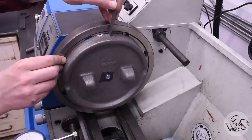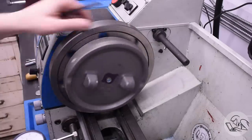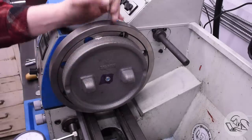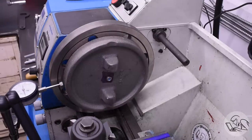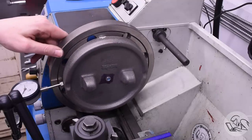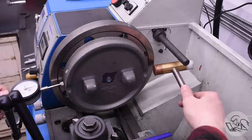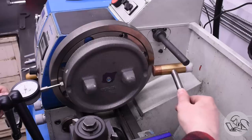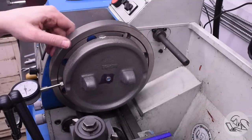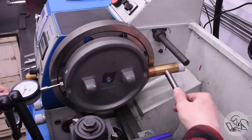To get this thing dialed in it's going to be tappy-tap-tapping time. I start with a scale to get it in the ballpark — that'll save a lot of time with the dial indicator. Once it looks good with the scale, I bring in the indicator. Again this thing is not round and it's a rough casting, so dialing it in is a bit of a fool's errand, but we do the best we can. I'm four-pointing it: choosing two landmarks 180 degrees apart — those little scallops on the casting — dialing in just those two points, then doing the same 90 degrees apart. That will average out the out-of-roundness error.